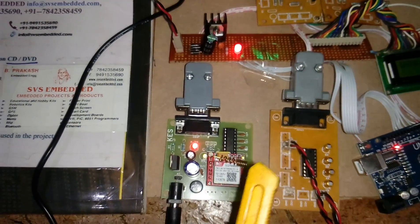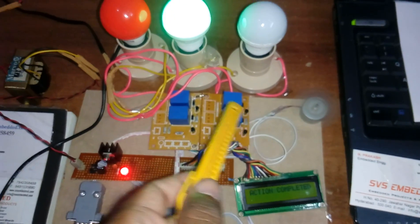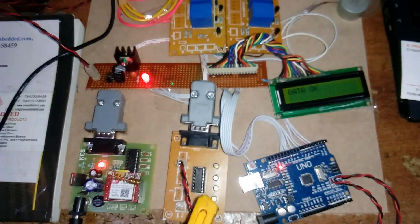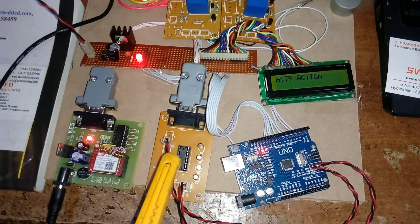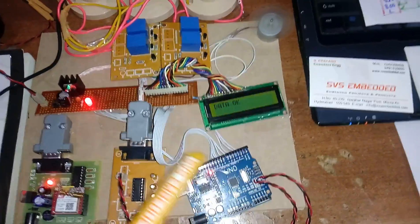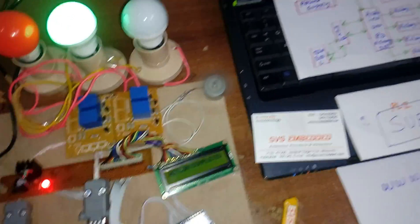Once we ping, the data is sent to the Arduino board and the process continues. The hardware includes a power supply section, 16x2 LCD display, four relay coils — three AC loads and one DC fan. A MAX232 IC is used as a voltage level converter for stabilization. RX and TX are connected to port zero and port one, connected via an RS-232 cable. Once data is sent and commands are received and completed, the action executes. There are three commands: send the link, action complete, and read the status.